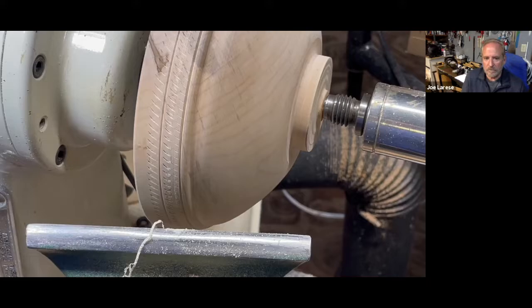Someone asked whether I cut the grooves after texturing, having seen people do the reverse, and whether it's just personal preference. Yeah, it depends — there are times when I do it the other way too. Whenever you're talking about carving, you should have some pre-planning. In making this video I kept screwing up, so that rim was much wider in terms of that raised area. Every time I screwed up I would just sweep across, so then you have to be kind of random. But when you actually want to do a carved piece and have an idea, drawings come into play. I usually do the patterns first because sometimes it'll pick and you don't know exactly where it'll go.